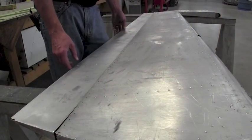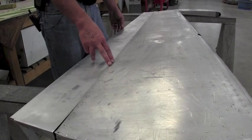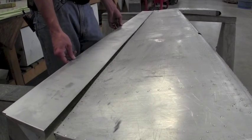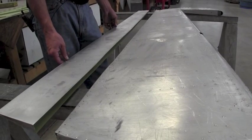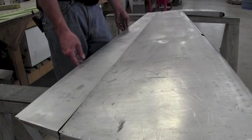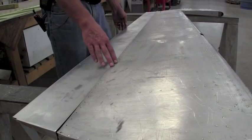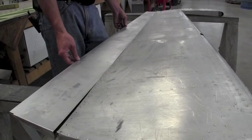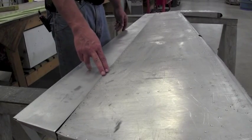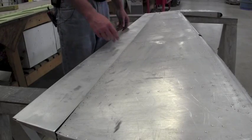The proper way to address this corrosion issue is to remove the fasteners along the rear spar of the elevator, remove the foam-filled trailing edge segment, replace it with a new style trailing edge, and then rivet it back into place. Many shops will do this in the field by simply installing the new trailing edge segment and using blind fasteners along the rear spar.